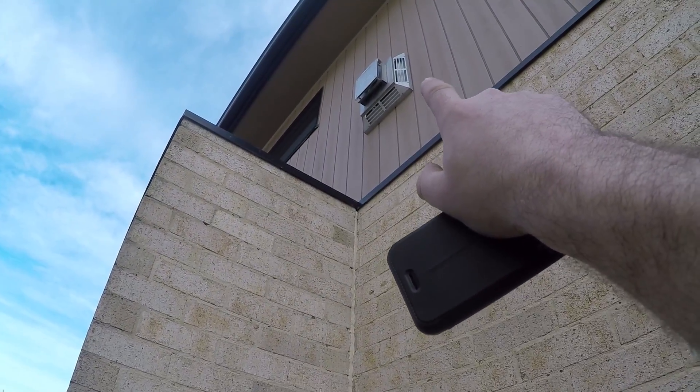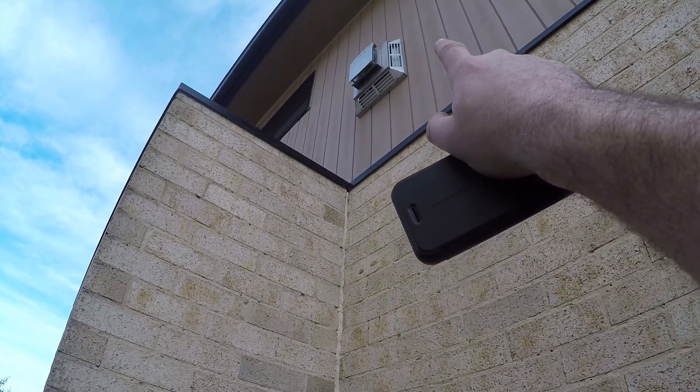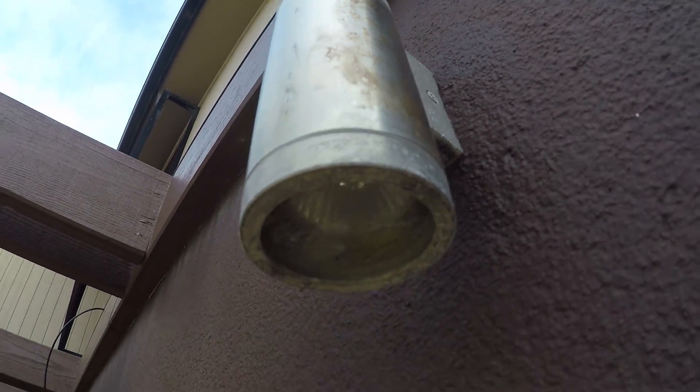Here we've got a breathing vent for our heating or gas system. You can see discoloration, but it's a high-quality zinc. Although it's heating up, it's not flaking right off and there's no rust — that's a really good sign. Copper is also something really good that can be used around sea areas. Copper won't rust away, obviously — it's a really good metal to use. It can just be a little bit soft, so you wouldn't be using it for structural integrity, just for cladding. Now, this is stainless steel and this is actually discoloring — there's rust coming through on the side of that. It's really one of those things where we're not sure about the quality of a material until we put it into a place like this that cops a good beating. It doesn't always pay to pay the top dollar, but it does pay to do your research and find good quality materials.